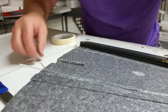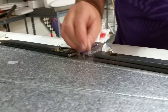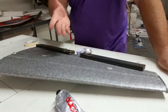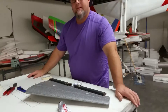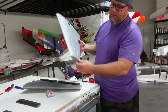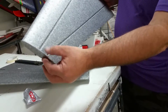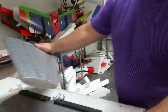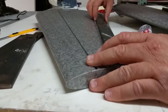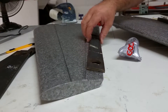Now I have a twist, and even when the spar is suspended in the glue, as the glue dries and shrinks and the solvents gas off, it does pull the spar right down into the slot. You do that with both wings on the trailing edge like this, and you do it mirrored exactly the same way on the top of the wing — the process doesn't really change. The only preparation I've done is cleared the bottom a little bit so when we press the wing it doesn't have a flooded edge. The most important part of the whole aircraft build is this trailing edge — pressing it straight straightens the airfoil.